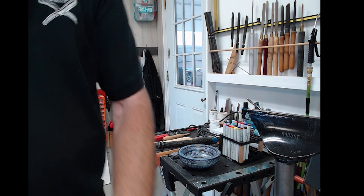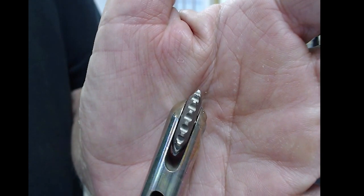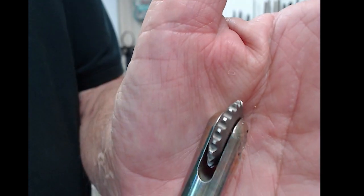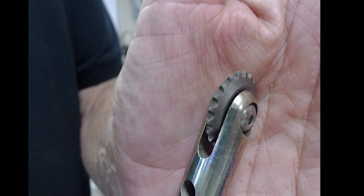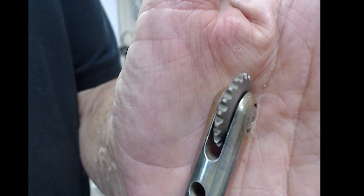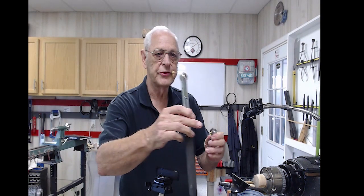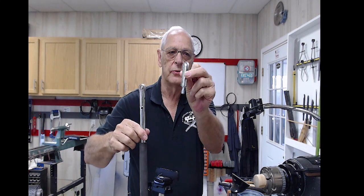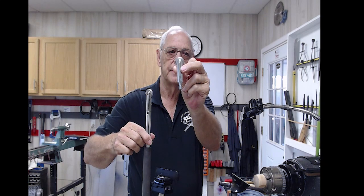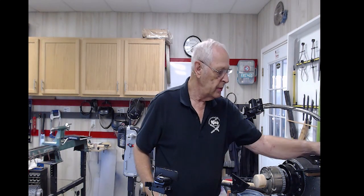This one is a Robert Hope tool — I had to order it from England from Hope Woodworking. You'll notice this one's not nearly as sharp as the Sorby tools, so it makes a completely different pattern. This tool goes together a little differently too: the gear is captured in there and you can't get it out, but instead of taking the gear out, you unscrew the whole top end and there's another piece that screws in with a different gear.